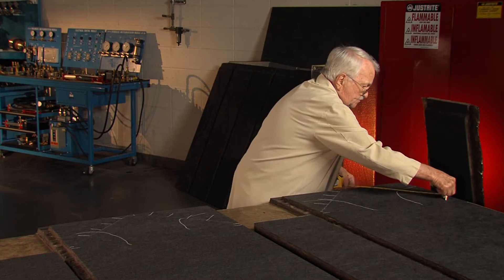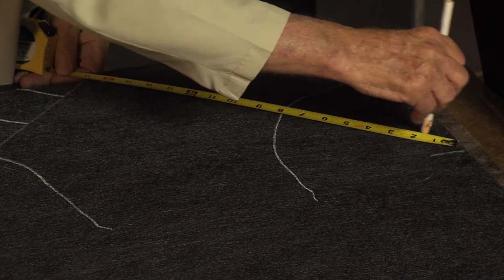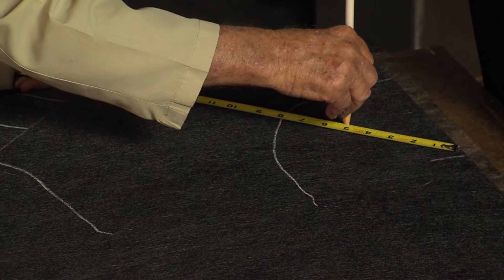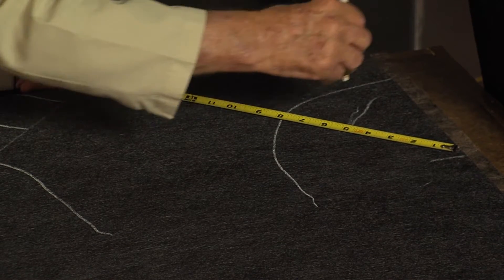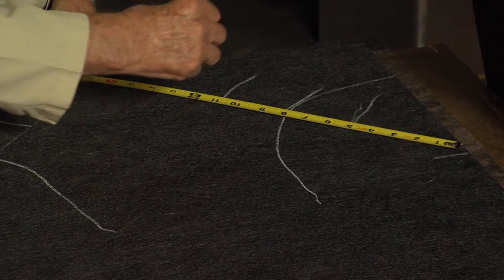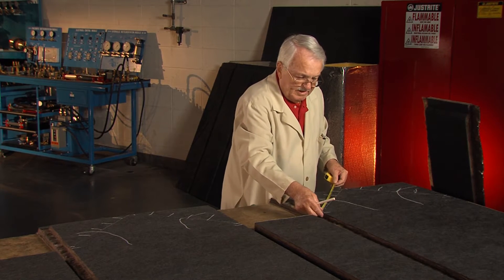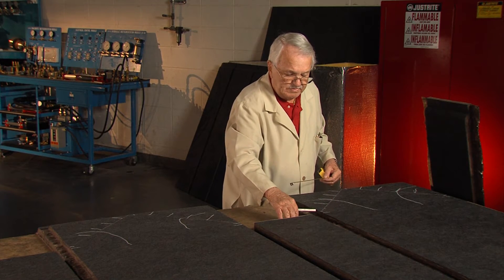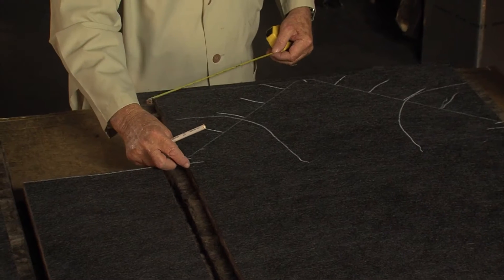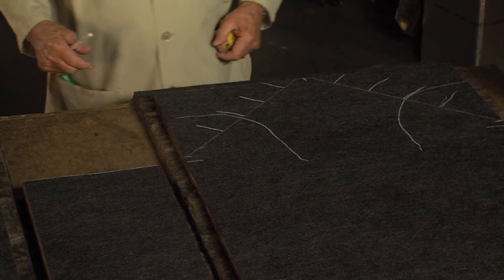Again there's that center line — I go five, three, three, three, three, and punch it in here to the center line. I go back five, three, three, three, three. Because of this duct coming in here it's going to fill up that much, so that's the reason we didn't go from that mark — we had to drop back three quarters of an inch.